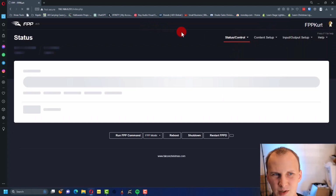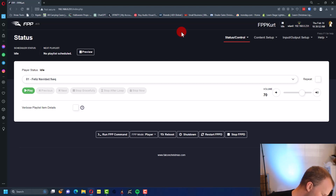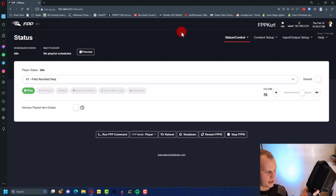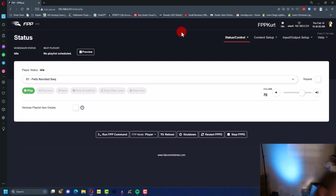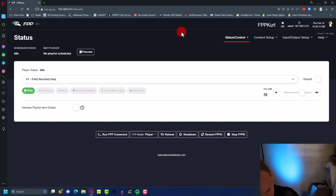Going to go back to our status page so we can show you that in a second. And now we're going to go ahead to our gear, right? So, like I mentioned, I've got the Kurt controller here with pigtails on it. I'm going to find my pigtail number 1 because that's the string that we plugged into. And then I'm going to grab my adapter from mini plug to X Connect for the RGB trim and connect that up to the RGB trim on the male plug because that's pretty much always inputs on this stuff, though it's not actually standardized.